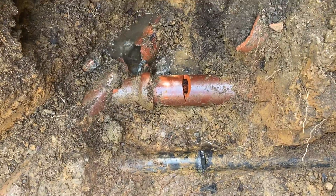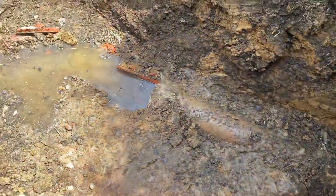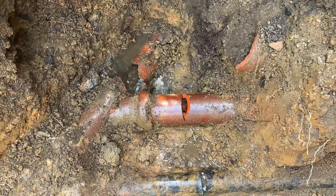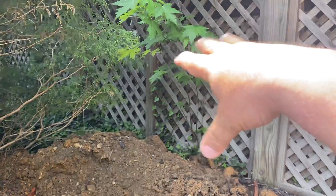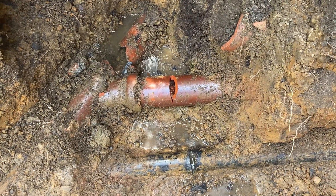Here's why we have multiple lines to look at. Now it's open and there's a high likelihood they're going to compromise our entire job. For the first part, for catching grade, this clay pipe is coming from that direction and it's for sure picking up the toilet and the sink in the basement. We have not been able to identify what it's used for, but it has to be reconnected.